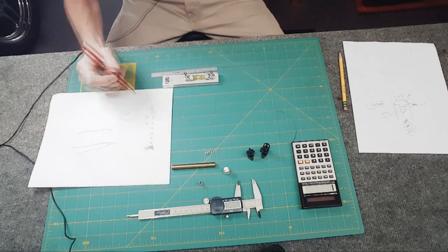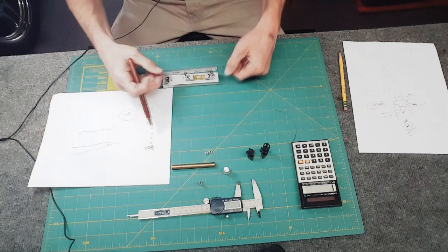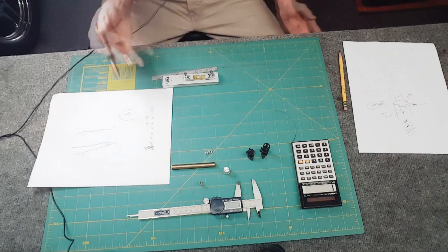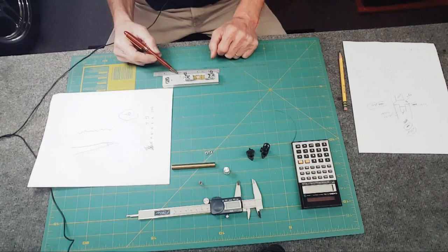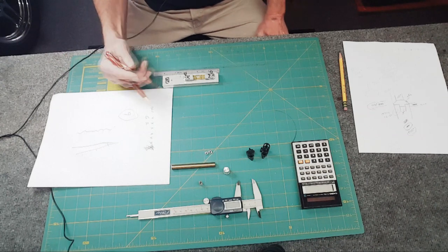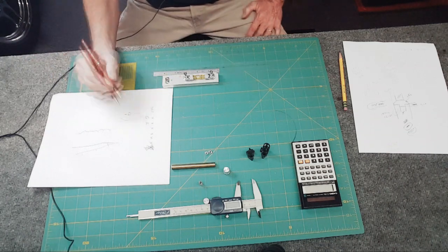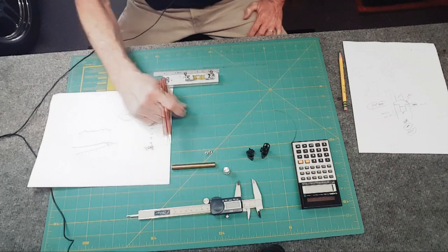The Starrett always has a small level for tilt, but since this vial is straight it doesn't matter whether I'm angled or not, so I'm not going to bother putting one on. I'm figuring 300 thousandths per side, so that puts it at about 3.7 inches total length. I'll cut it there and heavy chamfer all the sides.